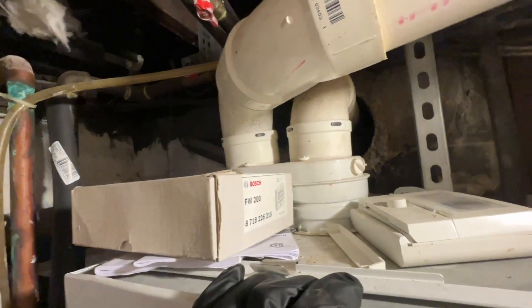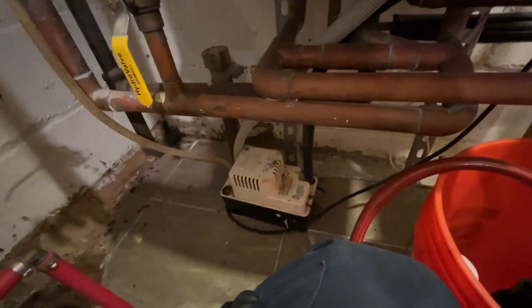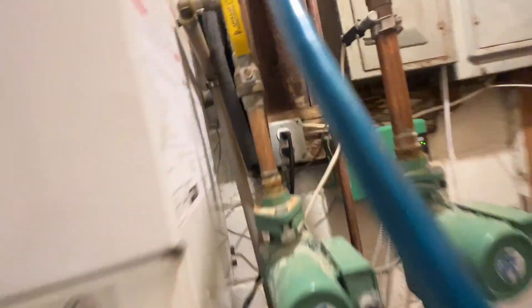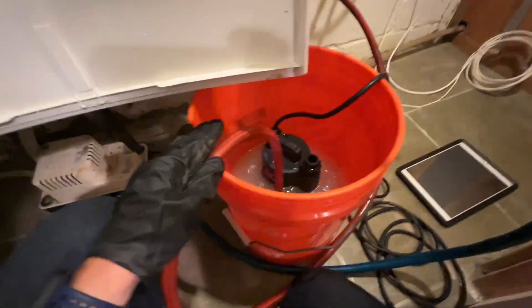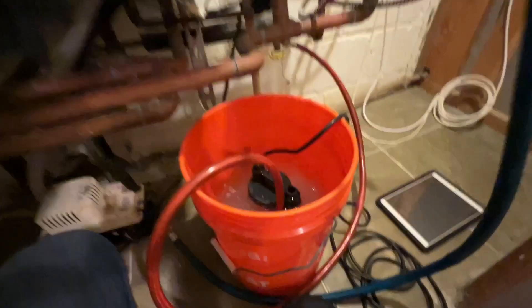Here's the Bosch makeshift manifold, but they do have valves in there for me to flush. No neutralizer because this is just ejecting straight outside. I'm going to get started with the flush. I'll open up the hot water, make sure it starts to heat. And as that comes out, I'll pull the power, which is coming in right there. I've got my bucket filling up, dissolving my chemical. It is about lukewarm water. My machine's power is off. Once this fills up about a little over halfway, I'll close my cold water in so I can start the flush, and I'll hook up my hoses.